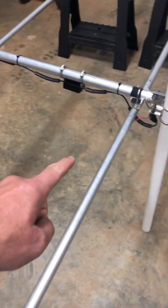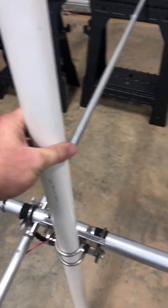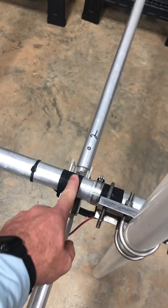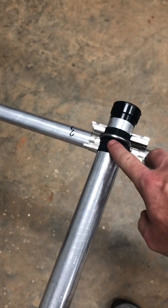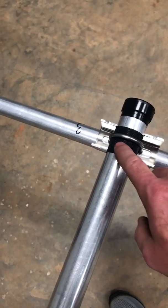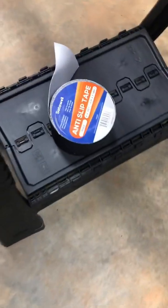This is element one, this is element two, and this is element three. When you get out here and you pick it up and start twisting and turning it, you get a lot of torsion because the aluminum is malleable. The U-bolts hold it but don't help with torsion, so element three especially can go out of level. To solve that, I watched a YouTube video from a gentleman in the UK who recommended grip tape — it makes a huge difference when you torque the bolts down, adding friction against the aluminum. You can get the tape on Amazon.